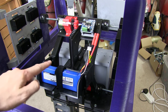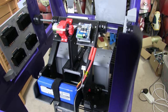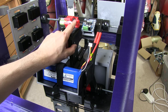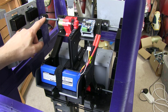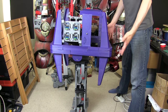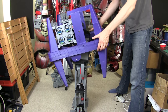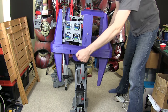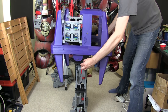I've made a battery mount that sits here attached to these arms, with a gap behind so the body can still lean backwards and forwards enough, and it also brings the weight quite a lot forward to balance it up. I've got one motor driver here for the ninth motor for this axis. This motor didn't feel torquey enough — I could back drive it really easily — so I've got one coming that's half the RPM and twice the torque. The aim is that as the box moves backwards and forwards it can offset balance; pushing this will push the hips in the opposite direction to stabilize front to back.